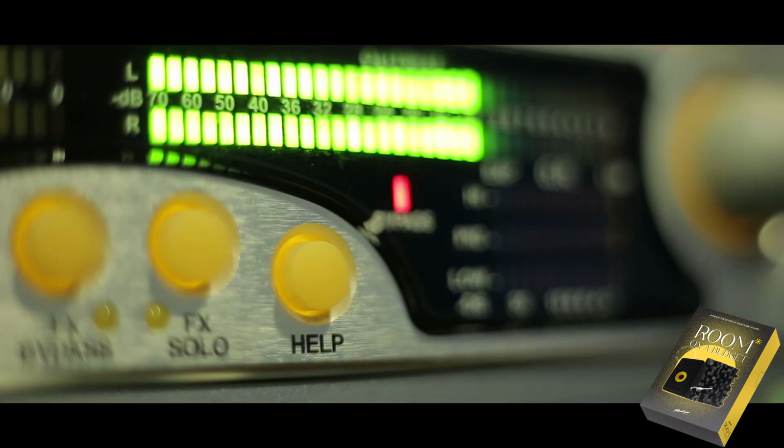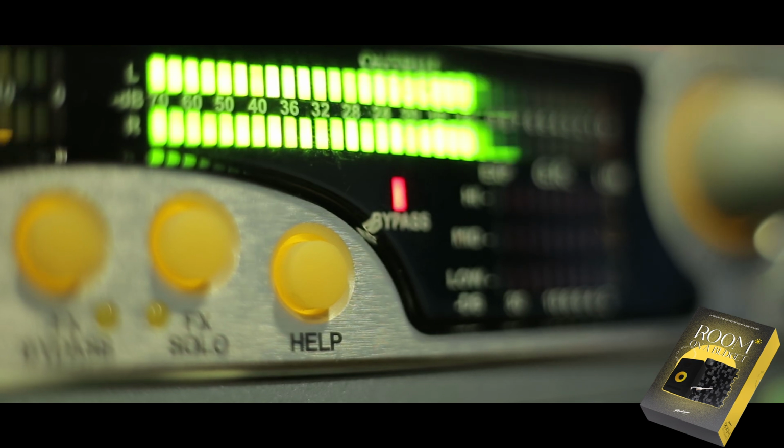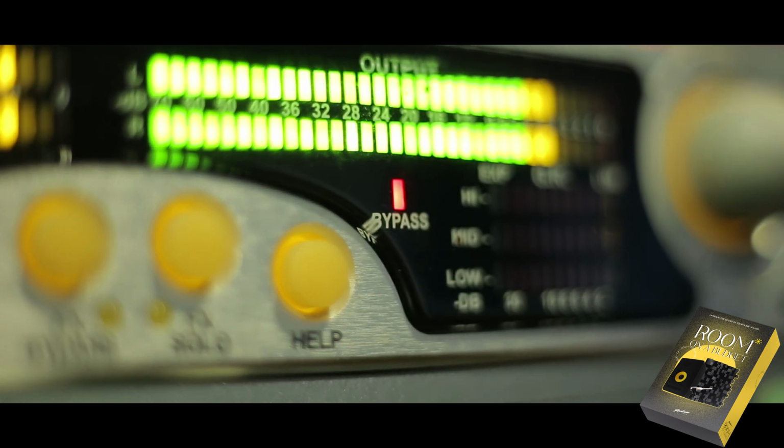The different materials that you want to use, wood, drywall, concrete, use whatever you can to have different materials to stop different frequencies from coming through the wall. The air gap between the different materials. Having air gaps allows more dissipation of energy, which gives you a higher STC rating, which means, that's right, we've got a lot more dynamic range in the actual studio. We have a much lower sound pressure level in the studio. We're gonna hear everything much clearer.